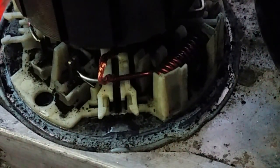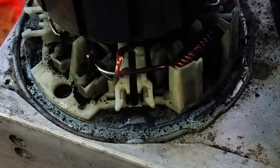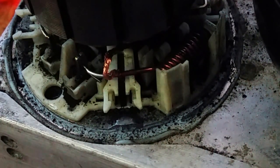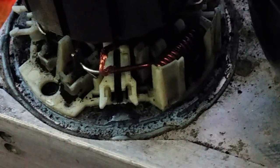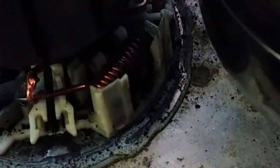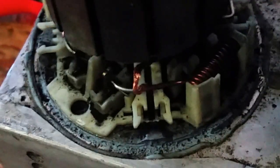When I solder these, I'm not going to use a lot of solder — just a dab. The thing to remember with this wire is that right now it's flexible — it's a copper flexible wire. Once it gets solder in it, it's no longer going to be flexible, so there will be a spot with no give. You don't want a bunch of that. The whole point of this wire is that it remains flexible. One little spot where I'm joining them is fine, but you don't want a ton of that. I'm going to get my soldering iron in there from underneath to heat it, then come in from the top with the solder.